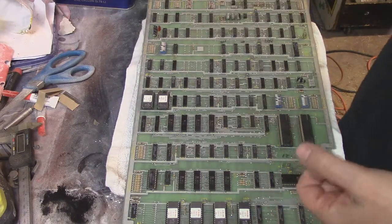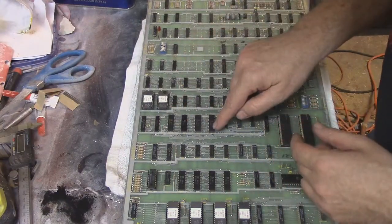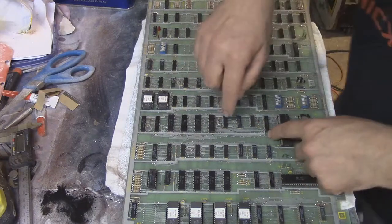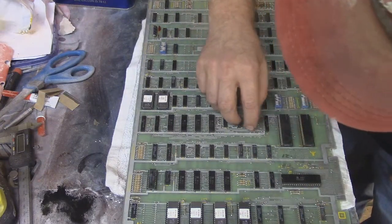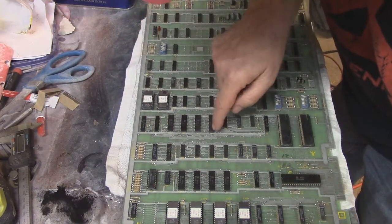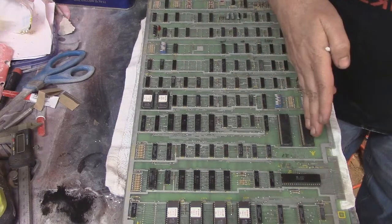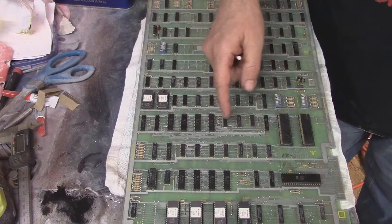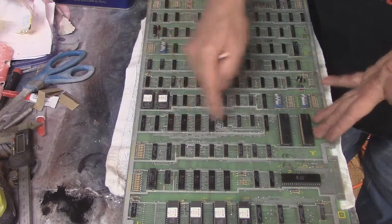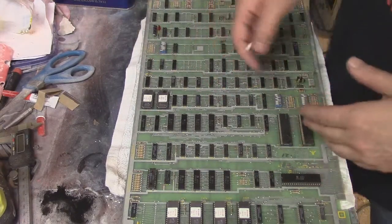I'm not going to get those until next week, so getting this thing started today is probably not going to happen. But if you look here on the board, it's really hard to see, but there are letters on these traces — this one says 4F, this says 4H, 4J, and then 4K is right here. They have these things labeled: here's 4B, 4D, E, F, G, all the way down. This is row four, because if we go one, two, three, four, and then they have it with the letter — A, B, C, D, E. Sometimes there's not an A, sometimes there's not a Q — it just depends on who's doing it. But we can see here this is a B, there's no C, then D, E, F, then it goes to H, J, K, L, M, N.